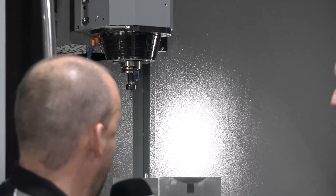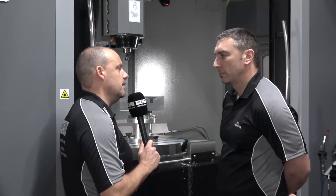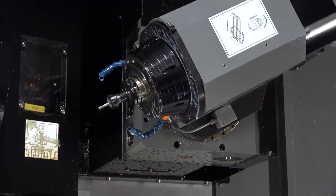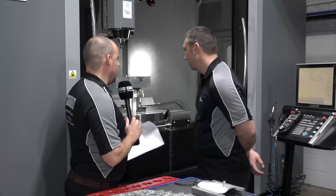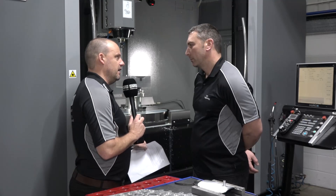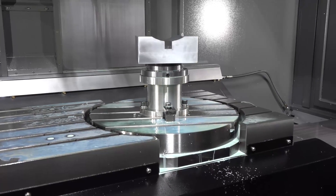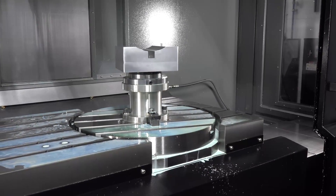On the detail of the machine head — what does that tip and which way, and how many degrees? 92 degrees both ways. It tips both ways? Yes. And your C-axis on the table — that's a 360 correct? That's correct. Does that sit above the fixed table? We've got ours flush. Is that an option when you buy the machine? Yeah, you can have it where you want it — we decided to have it flush for our three axis work.